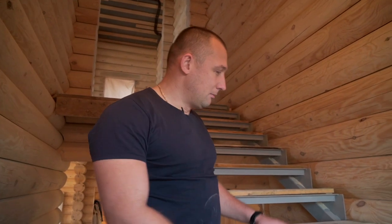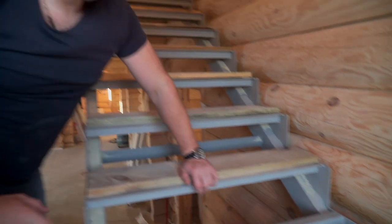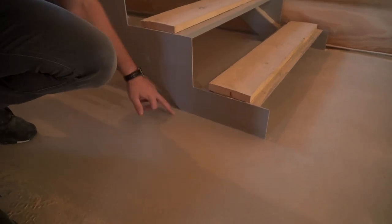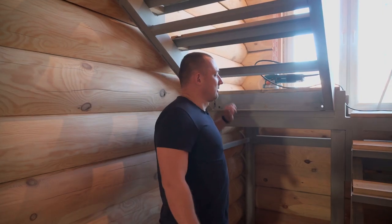A completely separate story is when the chases for the stairway get mounted in the house. Because then we come and start sanding, up until bumping into the stairway, and the yellow part stays. To get it sanded and painted — guess what we need to do? Exactly: a complete demolition followed by a reconstruction. We also had to cut the chases from the base and deal with the screed — either dig it out and butter the screed to take it out, or cut it and weld it back together. That gives us much more work to do. And my special greetings for those who installed this stairway — they not only bolted it, they welded it like it's gonna stay here forever.